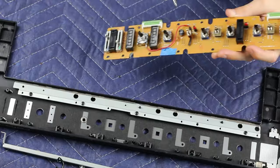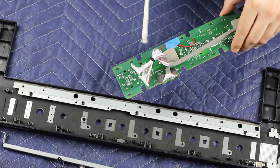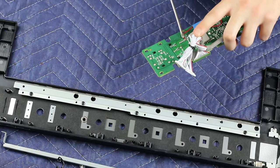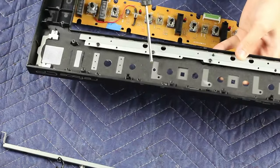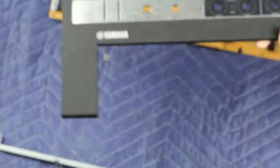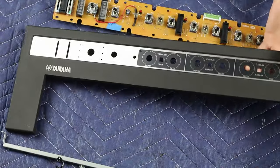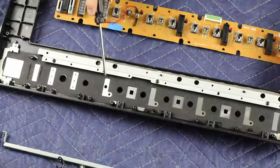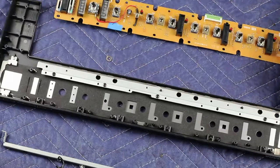You can take whatever path is most convenient for you to run a wire through. Back on the front panel, I drilled this hole for the switch. I took a straight edge across the center of all the holes for the knobs, marked and drilled right where the spacer was underneath. There's not a lot of depth between the inside of the front panel and the surface of the PCB — the switch just barely fits and it's right to the deck.